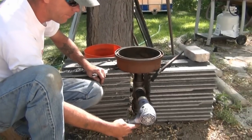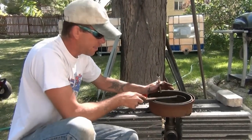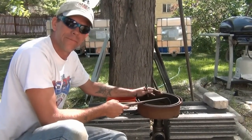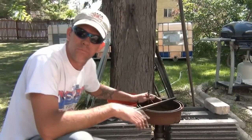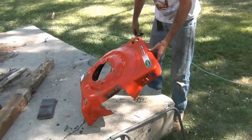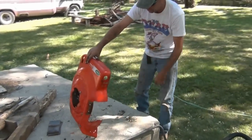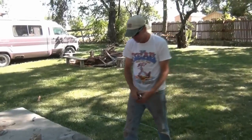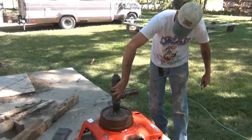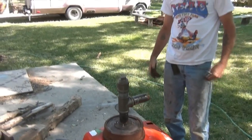Let's take it one step further. I found there isn't quite enough space, and I'm always adding coal every 10 to 15 minutes. So I've got an old lawnmower — it's a three-in-one mulcher and we've knocked everything off of it. What we're going to do is weld that drum around the bottom of it, right over it, just like that — bead weld it all the way around.